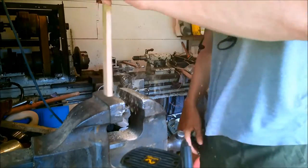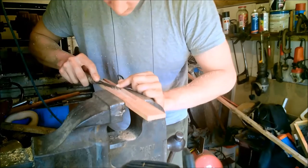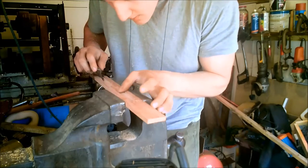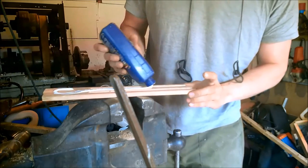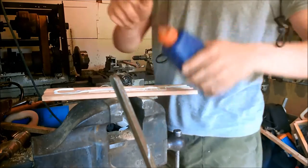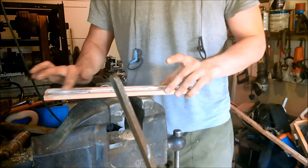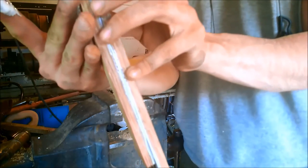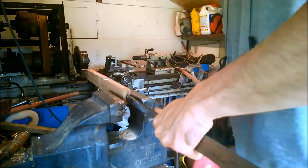Each block then has half the thickness of the tang cut into it using a router, and is then cleaned up by hand using some chisels. Once everything fit nicely, it was then glued back together. They were placed together over the sword tang to ensure that they remained lined up before clamping them together and removing the blade.